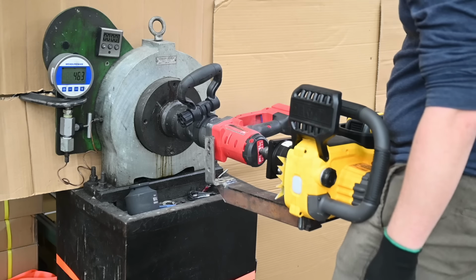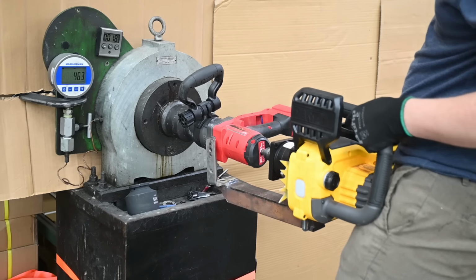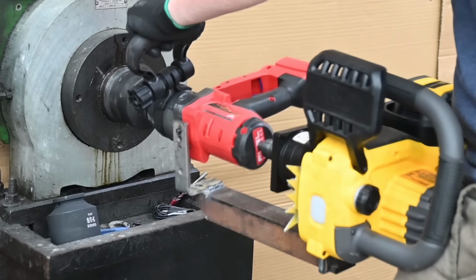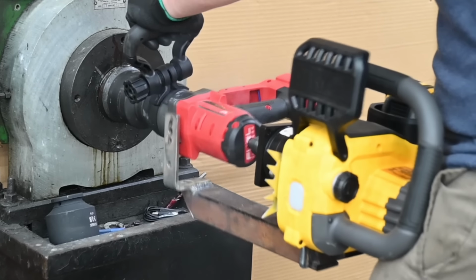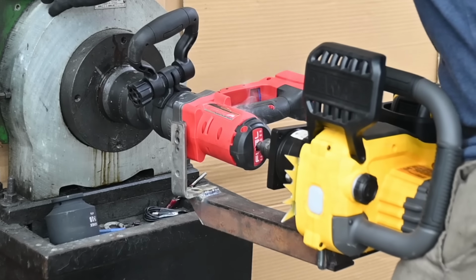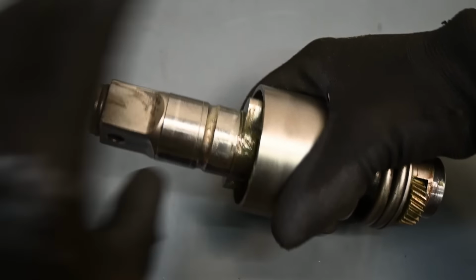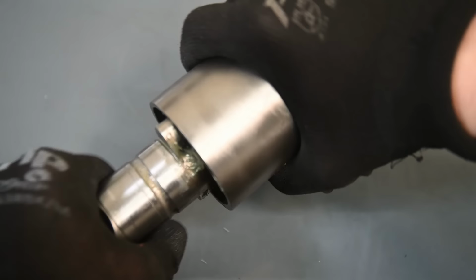Yeah, this guy wasn't named the Chainsaw Massacre for nothing. In this run, it just killed about everything. Stripped the last remaining bolt out of the head here, began smoking profusely out of a tool that doesn't even contain motor electronics anymore, so that's an achievement in itself. The hammer and anvil fused together in a sort of half-overlapped way, real good. This took a bearing puller to remove, and the alignment shaft now looks pretty chewed up.